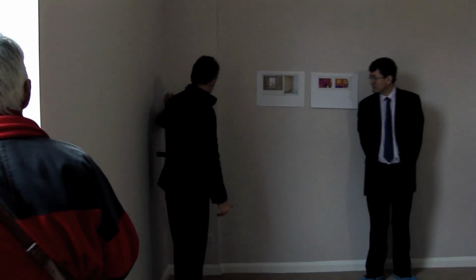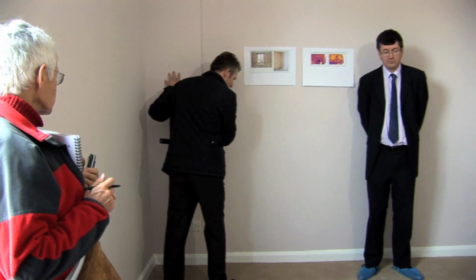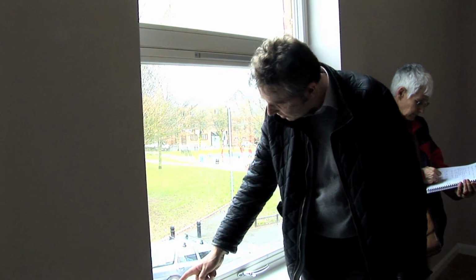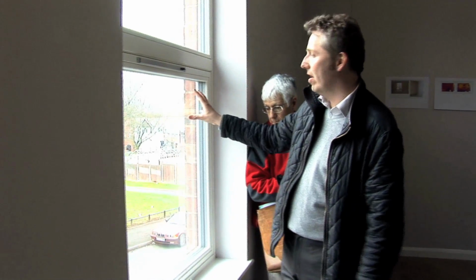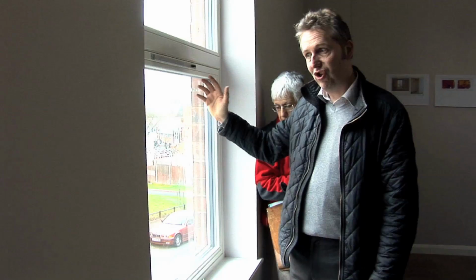One thing to do as well, we have to insulate the reveals here for the cold bridging. So you insulate here as well. This junction here with this wall. So this isn't the full thickness. This is 30mm. Triple glazed windows, argon filled. So you've got 18mm distance between this pane and the middle pane, and another 18mm distance between the middle pane and the outer pane. And they've got warm spacers as well. So normally you would have aluminium spacers. The U value on these windows is 0.9, so they're about 50% more efficient than a window that complies to current building regs.